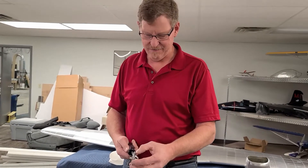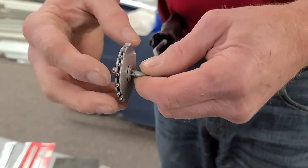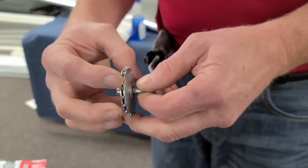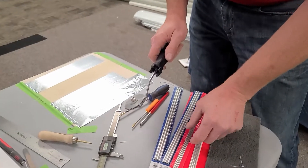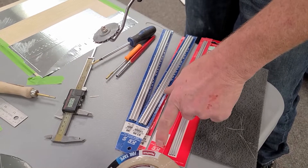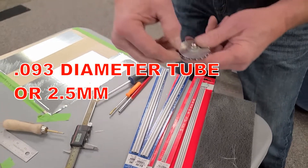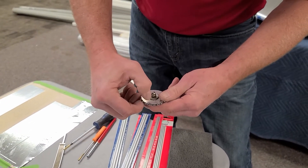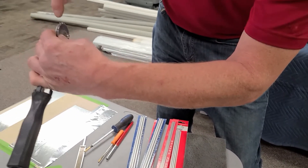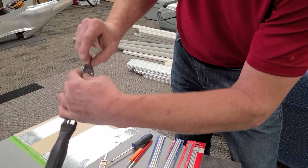It comes with a slot right in it. I just put a couple more washers so it would run a little more true. Then I took this tubing that you can find at Hobby Lobby or a lot of other places — K&S makes it, you can find them online. This is a 93 thousandths tube. I marked this out on the side of the wheel and put it in my drill press, drilled a hole in there, and pushed pieces of that tubing in, leaving them a little bit long.